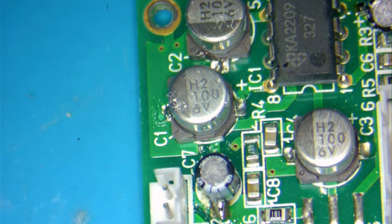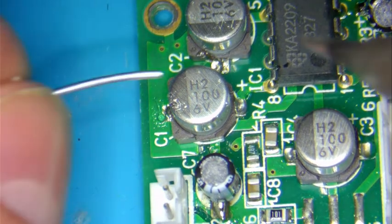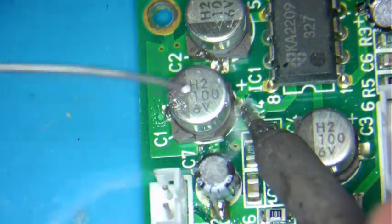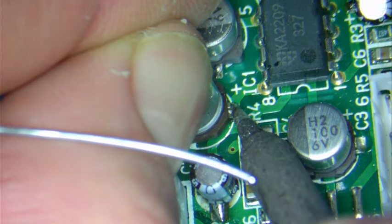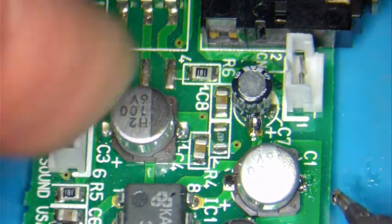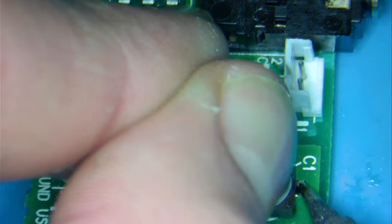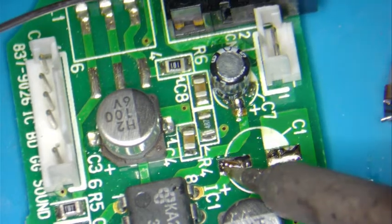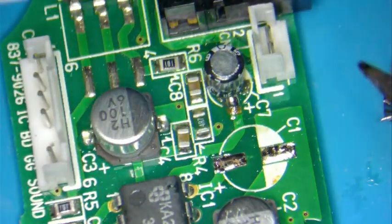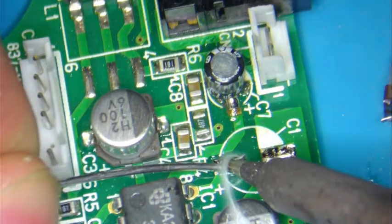The way I do it is I apply a little bit of solder. I use my thumbnail here to kind of pick it up — you pick it up a little bit and it's good. So you know that that side is done. I am mixing this solder with the other solder that is already on there. The solder I am using is low temperature solder so it melts really fast. You can see that we lifted the capacitor properly — apply a little more solder.